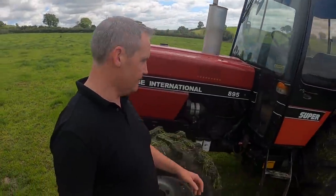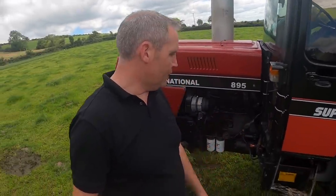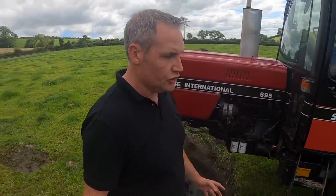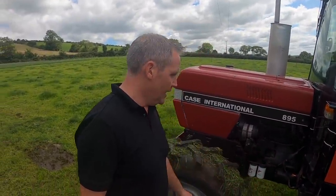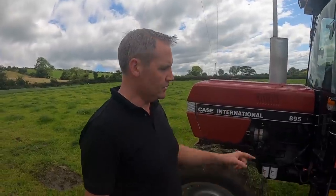The fella I spoke to on the phone told me, absolutely, guarantee you, because this little bubble here that primes it, I thought it maybe had gone soft or something and it was sucking in itself and that was what's starving the fuel, but it wasn't. Actually, the problem was much further back. It just basically could not get any fuel out of the tank. So the one on the far side was dirty. Yes, it was dirty and I blew it out with an airline. The one on this side was completely blocked. So that was the reason that when I was tilted at a certain angle, I was getting no fuel whatsoever. And that's why she was conking out on the verge of the hills, if that makes sense.